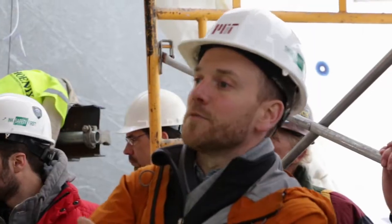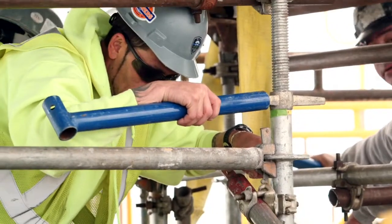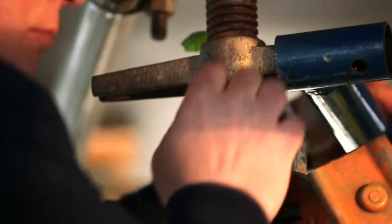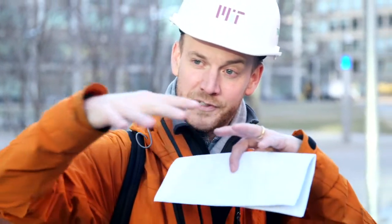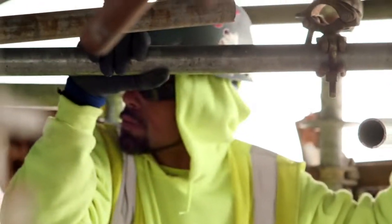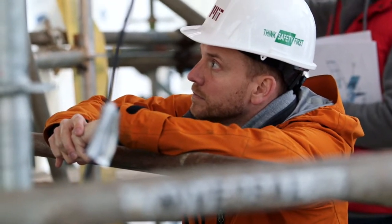So we're going to go ahead and start with the 4 middle ones. 1, 2, 3. Half inch. As we lower the temporary supports and they come down, the load on the scales should come down. And the load on the scales will be going down because the weight of the stones will be going into arching. If we lower the supports and the reading on the scale doesn't change, that's bad.